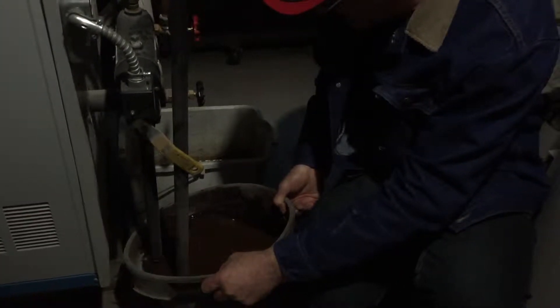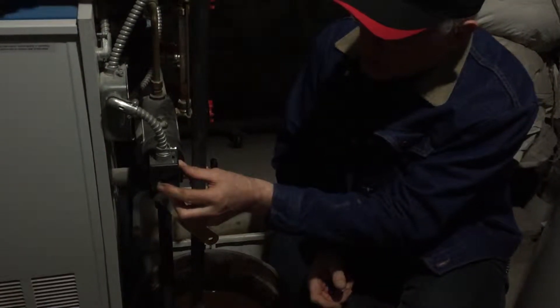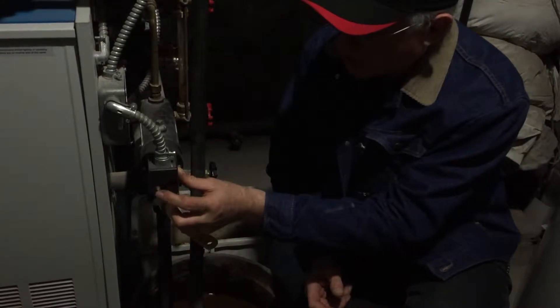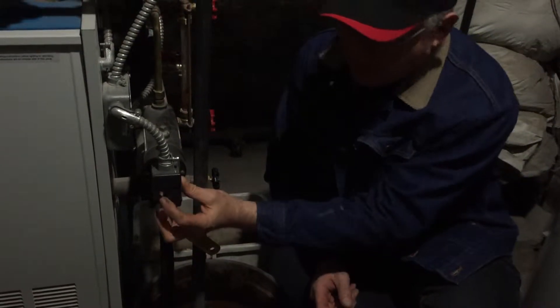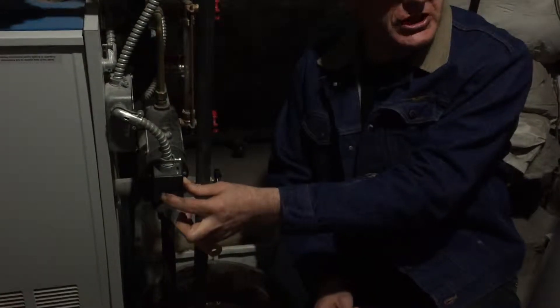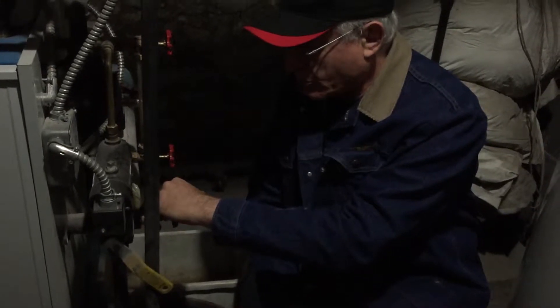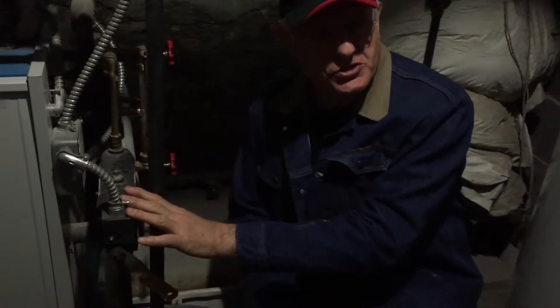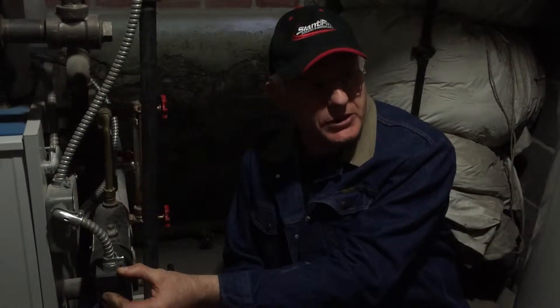As it is, it's going to be a problem — we'll bail. So every time you drain the manual reset low water cut-off, you have to press this reset button and you hear a click the first time. The second time you don't hear a click because you make the float go down and it registers a low water condition, and it's not going to restart until you press the reset button.